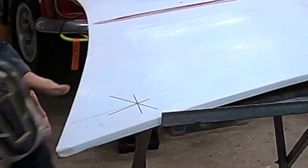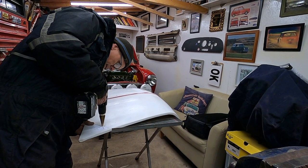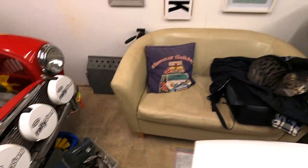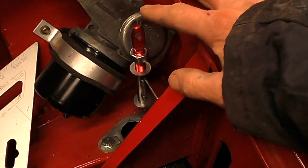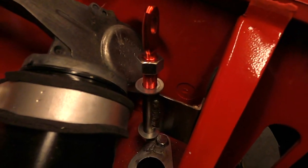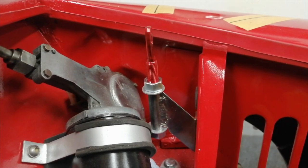I'm really pleased with the centre rib. However, it turns out that with the bracket I fabricated I'm actually three centimetres too low. I could definitely hack the bracket up to make it go higher so that this bit is effectively shorter, or I can fabricate a new set of brackets. There you go - there's Mark 2. I'm happy I did that rather than bodge the old one.